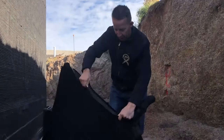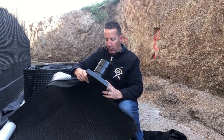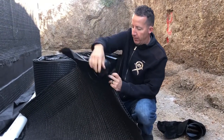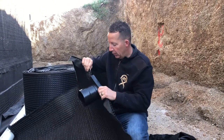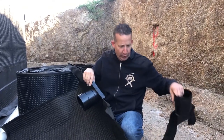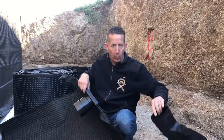This four-foot section has the fabric over the top to overlap against the last layer. These drain pieces that they recommend you install at 20 or 25 feet — if you install them and want to move them around, they actually slide pretty easily on the wall. These drain outlets are what we're going to tie our PVC French drain into. And then when you get to the very end of your run, this is basically the outlet drain that will tie into whatever you're going to drain it into. Here, we're going to have a wash to drain our water into.